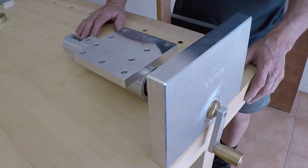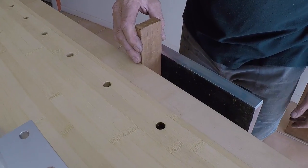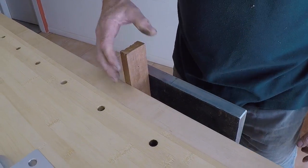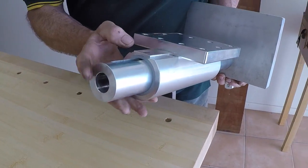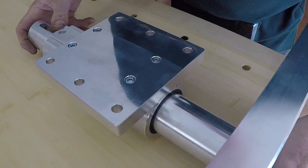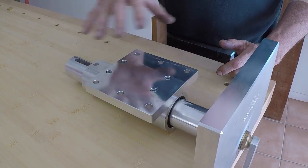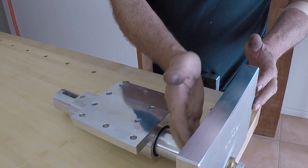The first thing is that it's non-racking. You can see I'm holding a piece of wood here in this vice without a corresponding piece here, and with very little force it won't rack. The reason for that is that this vice has a plastic bush in the back and also one up the front. These bushes are quite wide so that when this precision-made main shaft slides through it, it stops the vice jaw from racking.